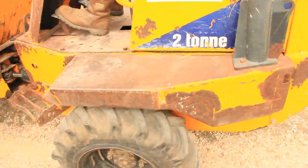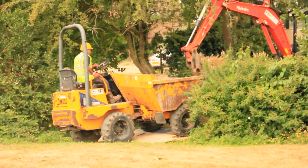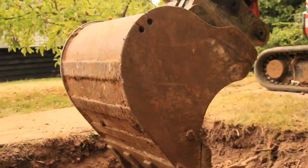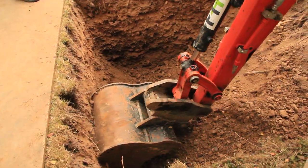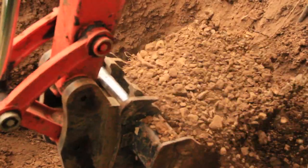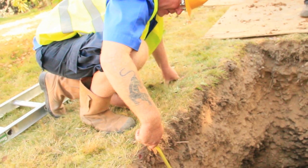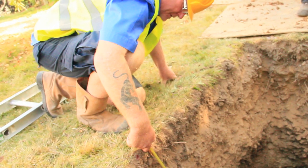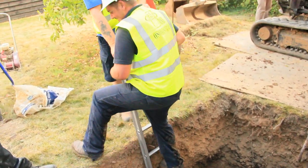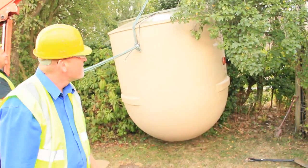Here's our chap back now to have his next load — they all work really well as a team. This bucket means we're very confident that all the pipes and electricity have been dealt with, and we're just going to crack on now. This is a very efficient bucket to use. Now we get on with the installation and we're digging to the required depth. We then consolidate the base, using hardeners to get it to go off very quickly, ready for the treatment plant.